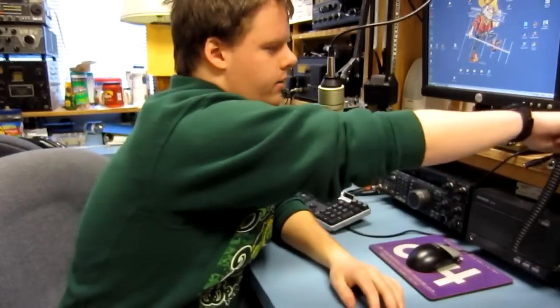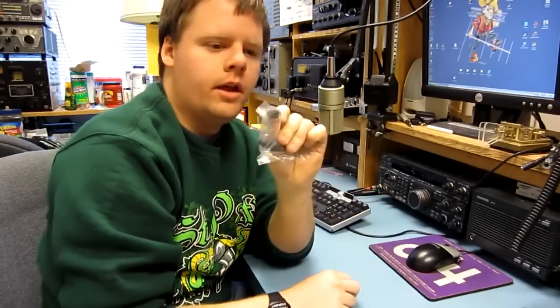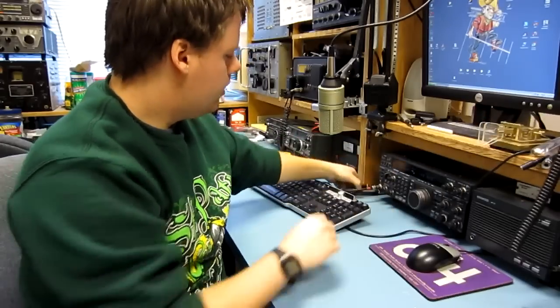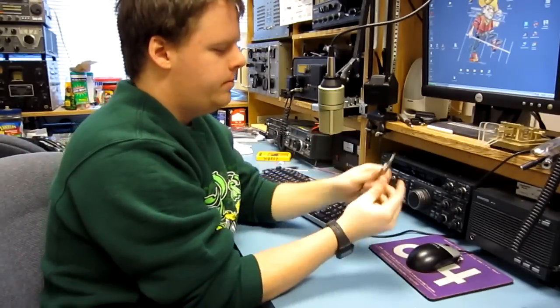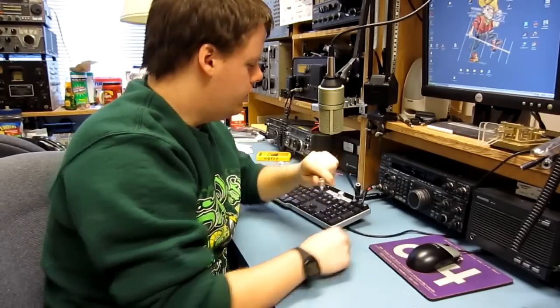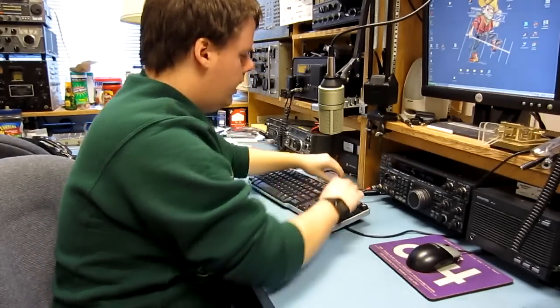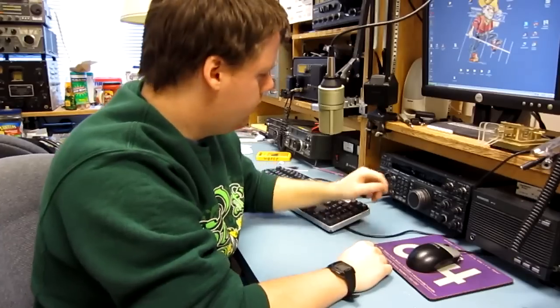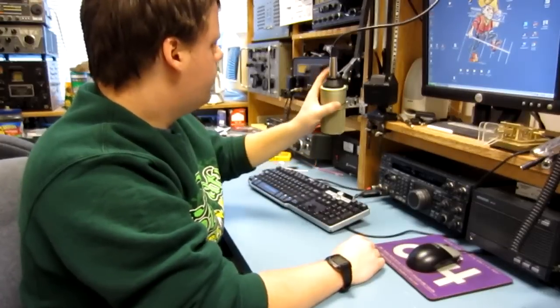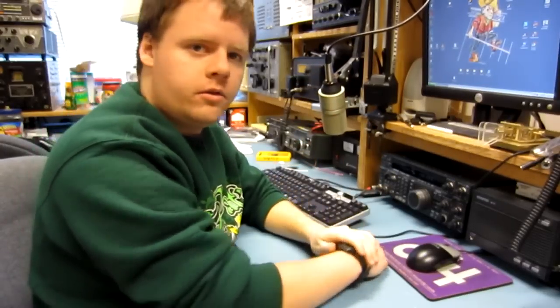Some radios, like the ICOM 7000, have a pinout on the back, so you'll need a certain adapter. Like this is a 7-pin. Some of them you'll need 13-pin adapters, and pull out a certain pin, connect it to probably the tip of the audio jack that comes out of the mixer, and plug that into the back of your radio. And so then you don't have to fudge around with the microphone gain or the preamp that sits right behind this microphone input.